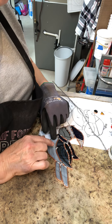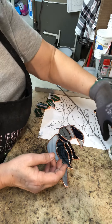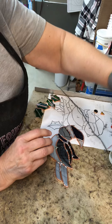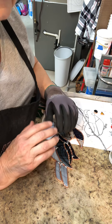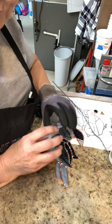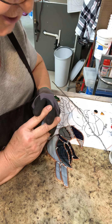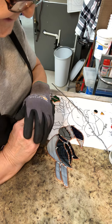There are different kinds of flux: there's the gel flux, there's the paste, and there's a liquid flux. My preference is either the gel or the paste. I don't like the liquid because if you get it on too thick, it splutters and hisses — it's like a little volcano erupting on the solder, and you get these little holes in your soldering work because you may have put on too much flux. So I find either the gel or the paste works nicely.